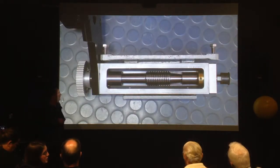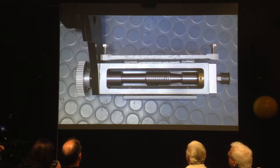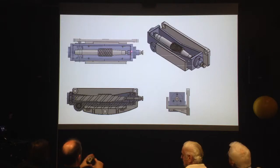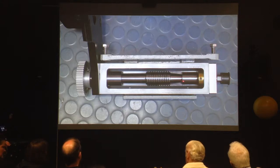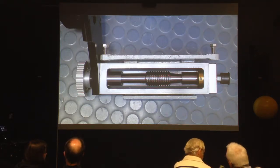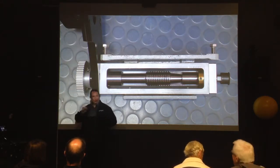If you remember the pictures I showed you before, this is the original Zeiss worm. It used to have a ball joint on the end there. When we took that off, Tony discovered that wasn't really going to be suitable. So there are two sleeves being shrunk onto that and put in a new piece of aluminium. It was also discovered that while this worm was in really good condition, it wasn't perfectly cylindrical, so it was put on the lathe and trued up a little bit.